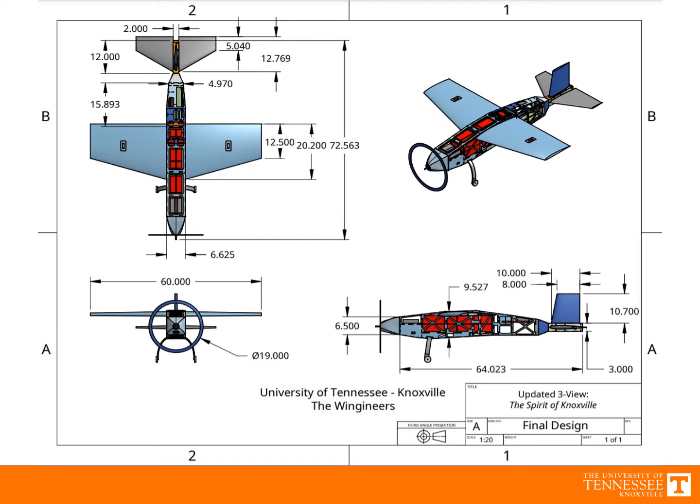As mentioned earlier, the design was modified slightly after the report was submitted, but the primary modifications were in the tail area. First, the portion of the fuselage where the stabilizer is mounted was made rectangular rather than tapered, so that the angle of incidence could be set more easily during construction. The stabilizers themselves remained unchanged. The second change was made to the deployment system, in this region, in front of the tail and behind the sensor simulators. To connect the fuselage to the rectangular portion of the tail, the fuselage taper was adjusted in both the vertical and the span-wise directions.